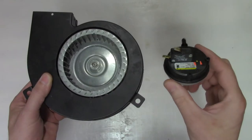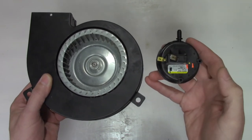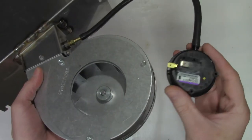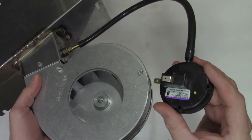To ensure the best chance of a first time fix for this one, take along the correct pressure switch. There's one that gets used with the older fryers for both series 100 and 200 with the black house blowers, and then there's a pressure switch that gets used with the newer silver house blowers. The change of this pressure switch took place around June of 2018, and you can refer to the parts list for the correct part number and the serial number break.